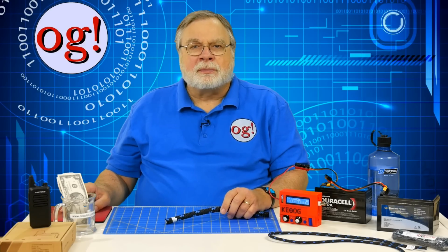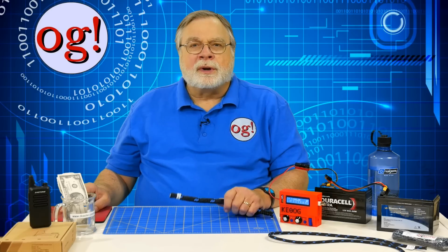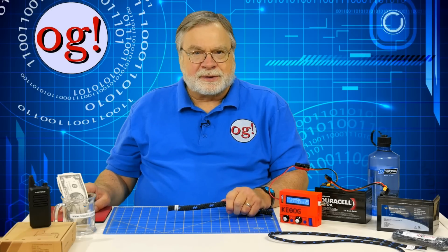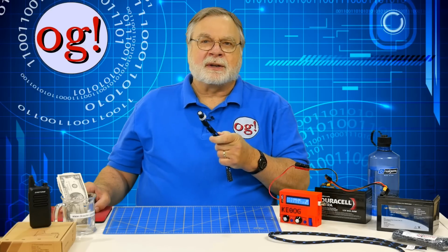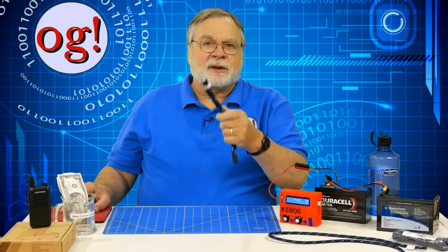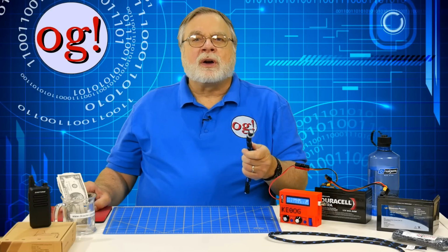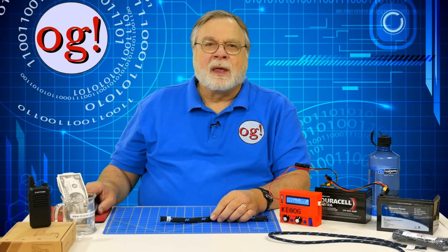This caution wouldn't apply in the case of a simple dipole, but would in the event you're putting up a tower. Note one other advantage of these guy ropes. They are electrically inert and will not affect the signal being transmitted. If you use wire rope for guys, you may need to put in insulators at various spacings along the guys to keep them from resonating. Charts for this are in the ARRL antenna book.